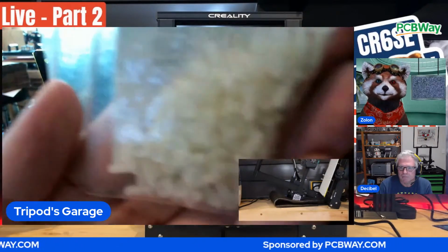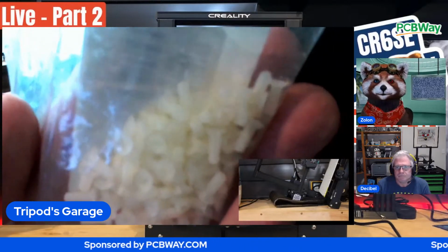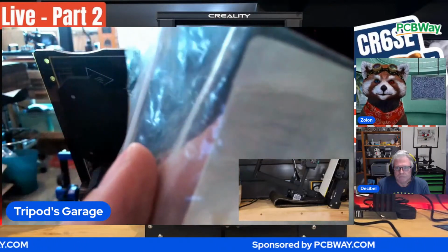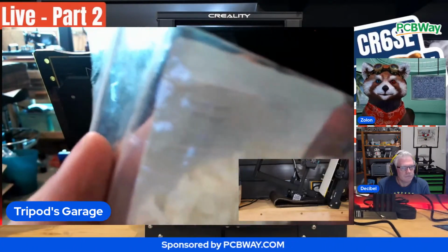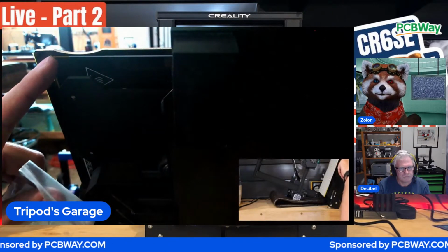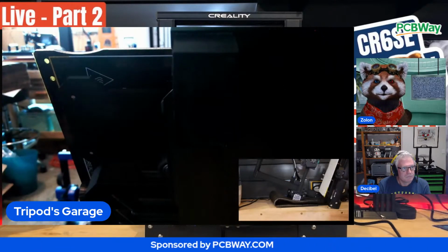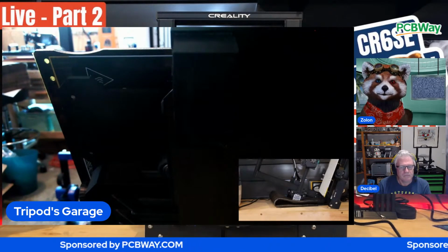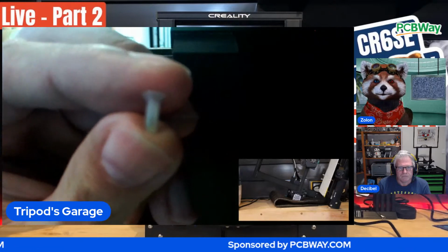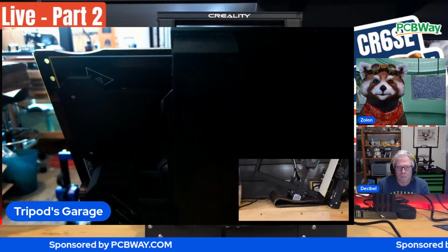So I was thinking that we were going to explore lots of things. I was originally going to put these nylon screws in, which torque down really well. But everyone was thinking at the same time that there was a possible short, but the traces are very close to these screw holes, but they're not that close. And the problem with these is that they will bend. This bent, of course, just after putting on the clamp and taking it off. So you would have to really maintain that.